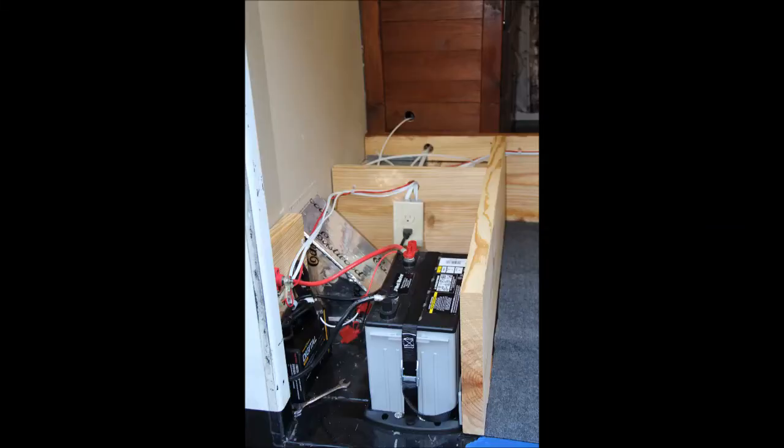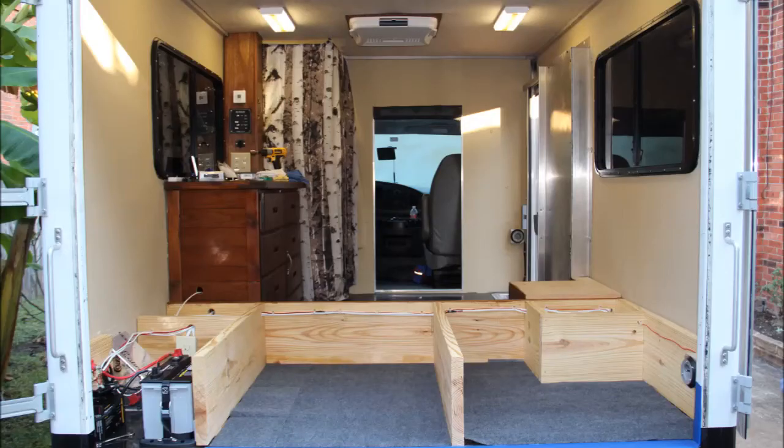Finally, you can see the battery connected to the Minn Kota 12-volt bus bar, the 110-volt outlet, and all the wiring running through the frame over to the outlet on the right-hand side and back to the main light power switch. This is the stubbed-out light — I'm carrying the power to this connector and then away again to the next light. There you go — the details of my electrical and Dometic Penguin AC unit installations.